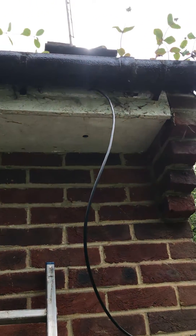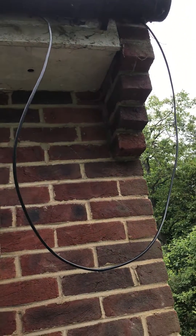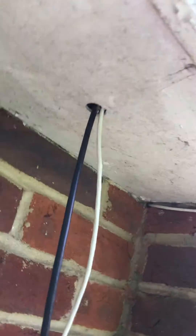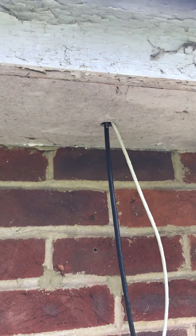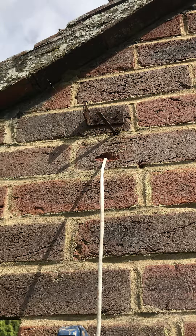And what we've done here — as you can see there's a little hole there — from that hole we've basically drilled into the soffit. If you've not seen the previous video, I've always used a coat hanger as my way of fishing cables, and I've been doing this for over a decade — it's always worked for me. We drilled through, pushed the cable into the soffit, and then basically pulled it through using a coat hanger. Now you can see here the reason there's two cables is because we are going to use this for a third camera. So the first camera you saw initially, but at this spot we are fitting two, which gives us a total of three cameras. We've basically tacked the cable along — as you can see that's going to eventually be filled so you don't see it — and then we drill through, which brings us to the outside third camera.